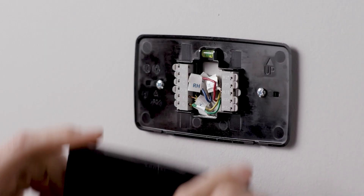It has all of the control terminals you're used to — ACC plus and ACC minus so you can connect accessories. It has an onboard humidity sensor so you can control the system based on humidity using your DH or de-hume terminals on the equipment. It has a lot of the functions you really need as a professional, and it's really designed for professionals.